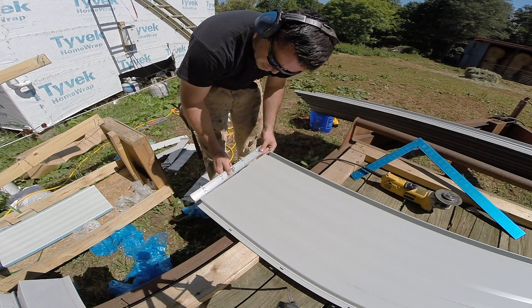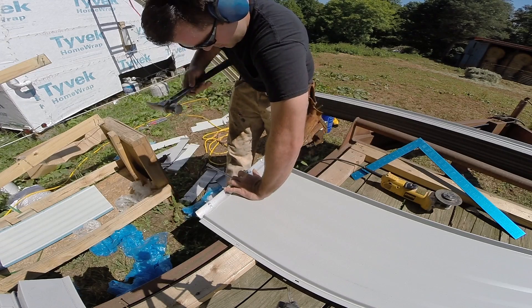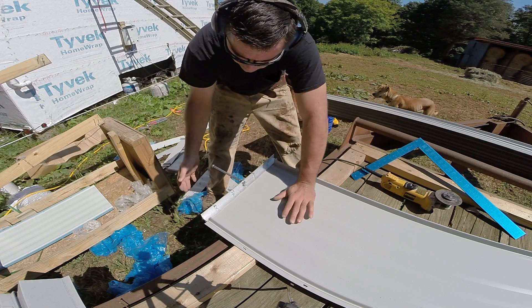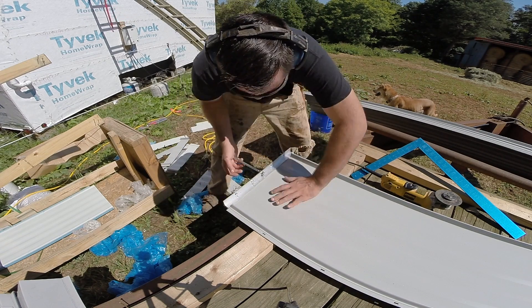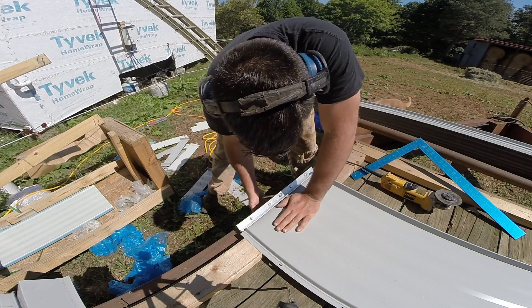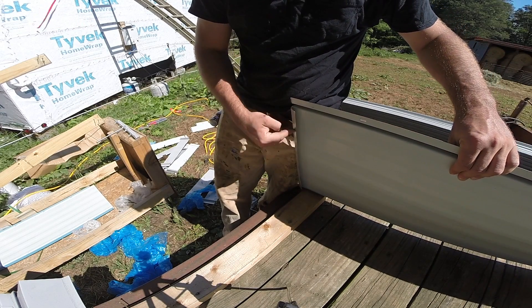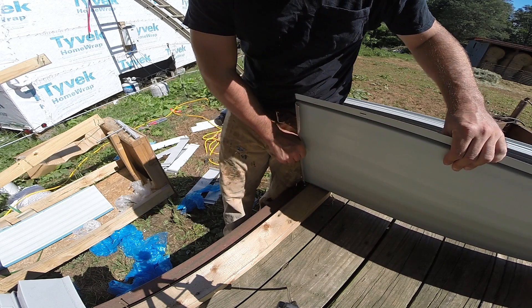I'm going to use my homemade brake. Stick it in there and just wiggle — hit it in there, make sure it's all the way in. This is one inch deep right here, so if I'm pushed all the way in and not hitting these points, I know I have full depth. I'm going to place the piece right against the wood here for a firm surface and start my bends. Once I bring it away, I'll bring it all the way up. I'm not going to worry about making this the perfect angle just yet — once I install this piece and the drip edge is underneath, I'll come back with some hand crimpers and crimp this down more.